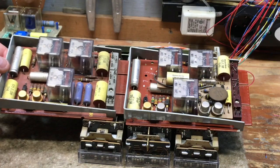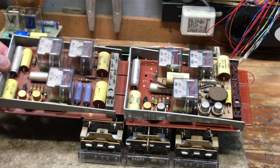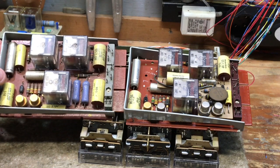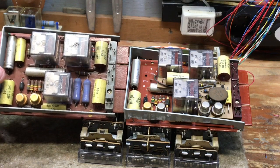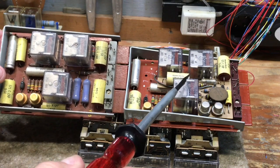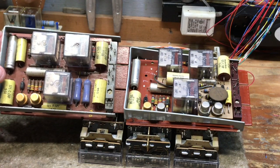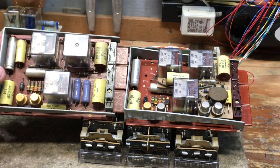The one exception to the Western Electric line cards when it comes to the leaky goo is the A, the B, and the C did not have a reed relay on it. These were made before reed relays were widely in use. So this line card will not have anything that will leak out of it. This is a B series, which is fairly common, and this is the C series. And this is the only single C series I've ever had in my lifetime. And I've never seen the 400A, but they do exist, or did exist.